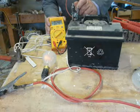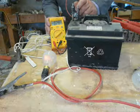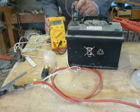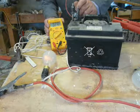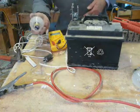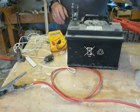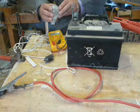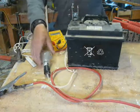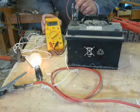The old tractor I use for cutting firewood — as seen in one of my earlier videos — the batteries aren't brilliant on it. So I have this very system just trickling the battery all the time at a quarter of an amp. It won't overcharge it but will keep it well charged. Now, what happens if we change the bulb? That was 150 watt at 240 volts giving us a quarter of an amp. This is a 110 volt bulb at 100 watts — let's see what happens.